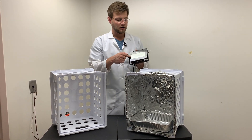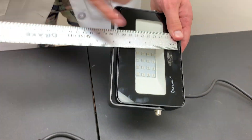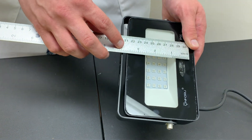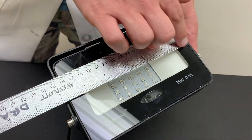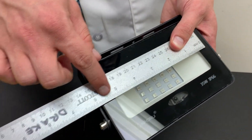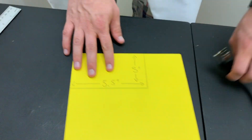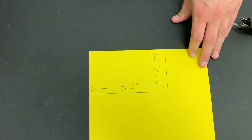So we're going to measure out from here to here. Using our ruler, we measure from the side of the IR sensor to the top of the light, which is roughly about three inches, and we're going to measure how big of a hole we need for the actual light, which is about five and a half inches. Using those measurements we're going to make a stencil — I've already done so — three by five and a half inches, and then we're going to cut that out.